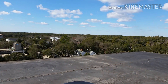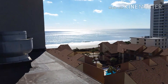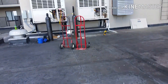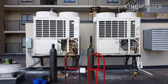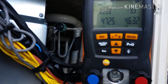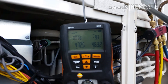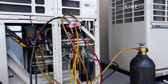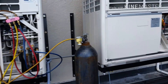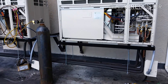Pretty damn nice view up here. We're on the roof of the 8th floor currently — not a bad view. Sorry if it's windy; ocean front, it's always windy. There's the units — they look pretty good. We're just starting our pressure test. We've been on pressure test for 38 minutes and we've dropped about 9 psi, so we're going through — I think there's 15 or more heads inside that go to these condensers. Just got to go through, recheck flare fittings, things like that. So far it's coming along pretty good — it's been an interesting one.